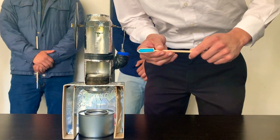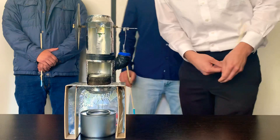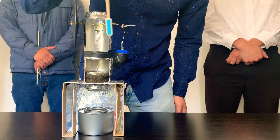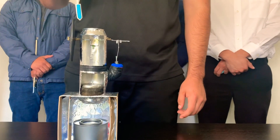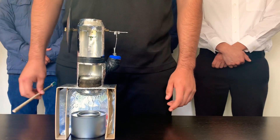The air expands and contracts the diaphragm, pushing the connecting rod which rotates the crankshaft. The crankshaft then converts rotary motion into linear motion to the diaphragm and also to the displacer. The flywheel is made out of two CDs held together by terminal blocks on the crankshaft, and adds the necessary momentum to initiate the Stirling cycle.